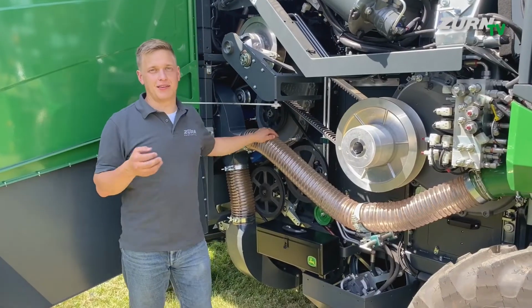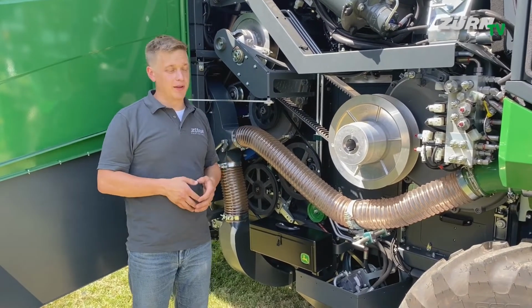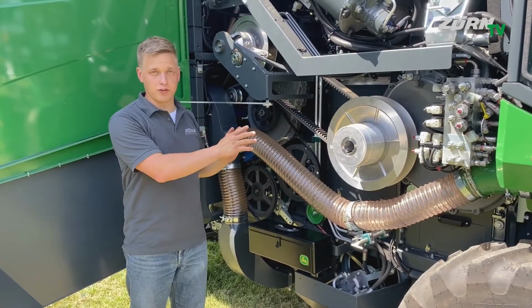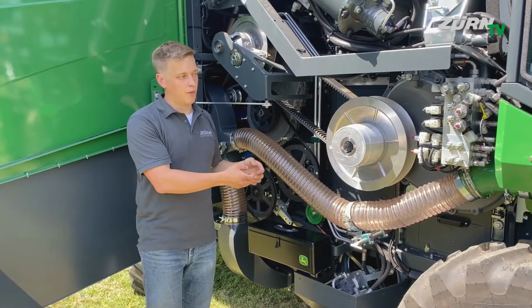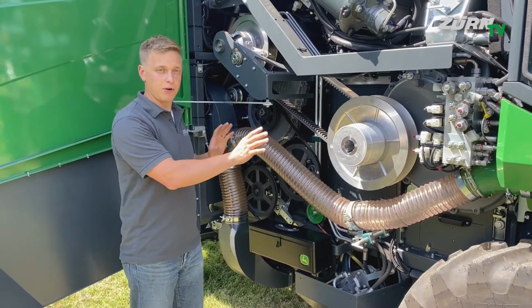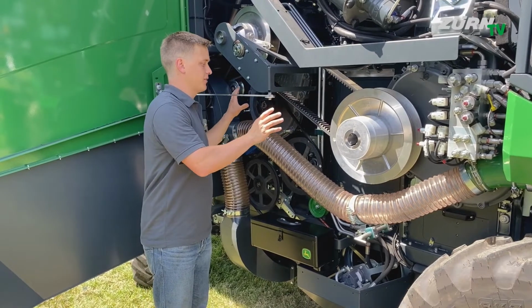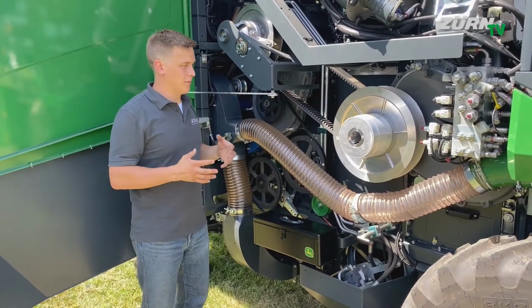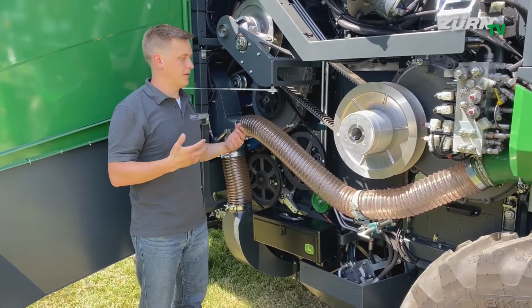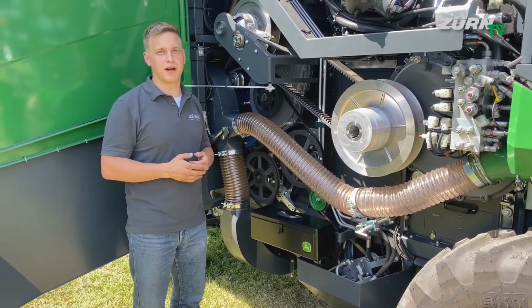In the field, it is essential that the engine power is available where it's actually required. Besides the ground drive, this is mostly the functional components like the threshing system. We have therefore had a huge focus on designing the drive line for all these functional components in an efficient way. So we have these gearboxes, only few belt drives, and make sure that there's enough power where you actually need it. And besides this efficiency benefit, this also is beneficial regarding serviceability.